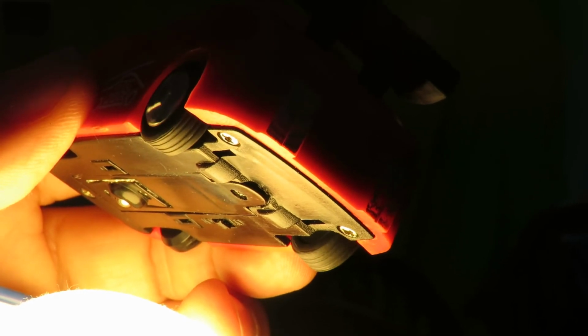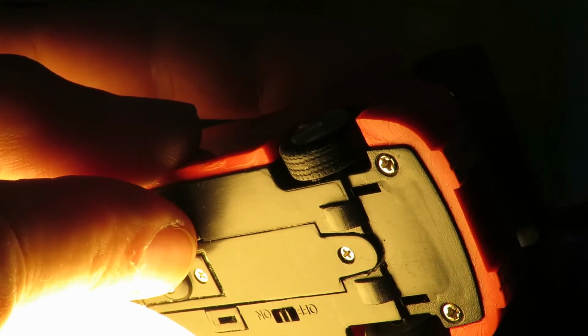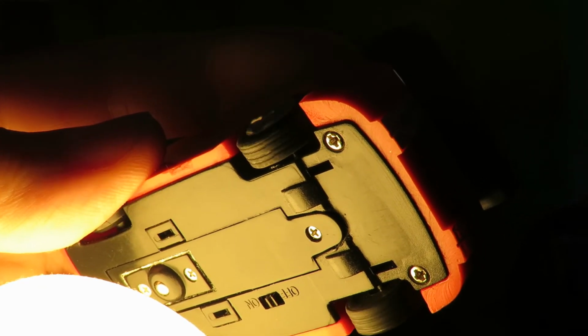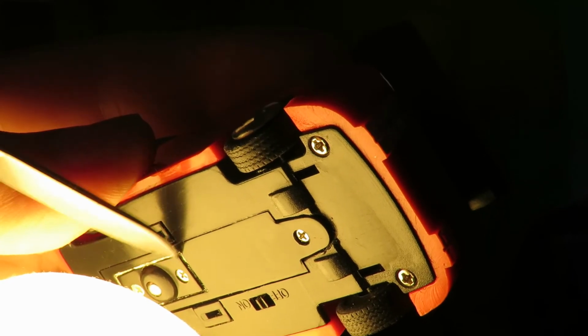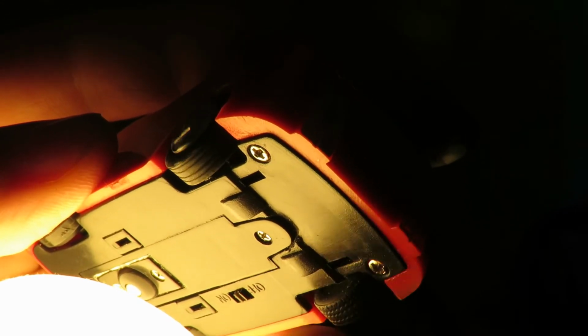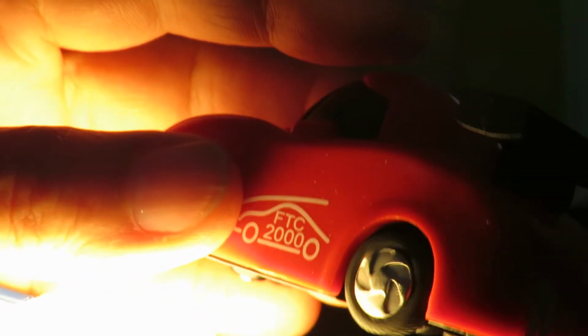Well, this doesn't actually help it work. But I found by complete accident that if I hold it directly over the light, so that's shining into the receivers, then I can get both wheels turning. So it's shining into that one, cover that over, stops it. Shines into that one, cover that one. So left sensor, left wheel stops, right sensor, right wheel stops. And that motor on the right is a bit intermittent anyway. Still, are we any further forwards? No, not really, because you can't use a line follower that needs a bright light shining directly into it. But we know the general circuitry works.